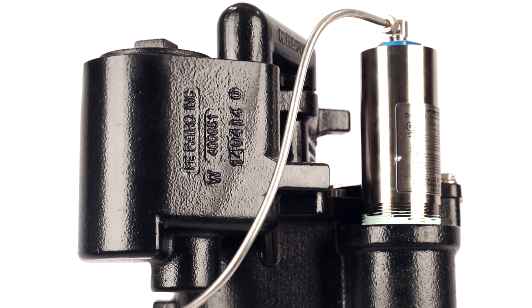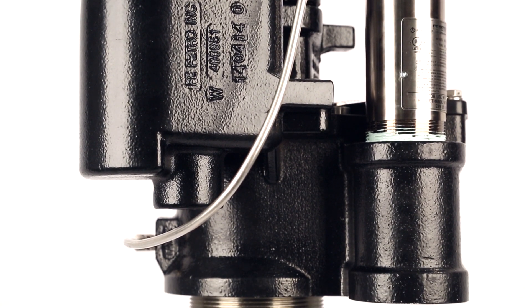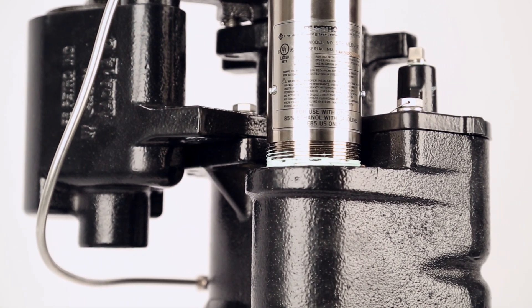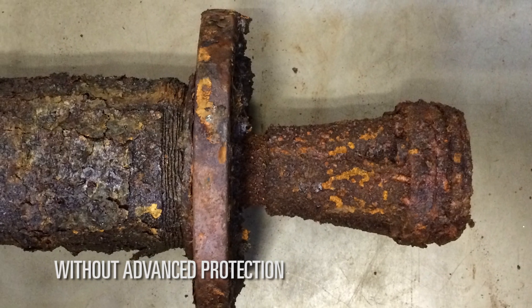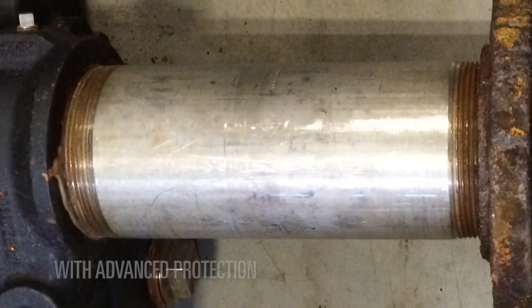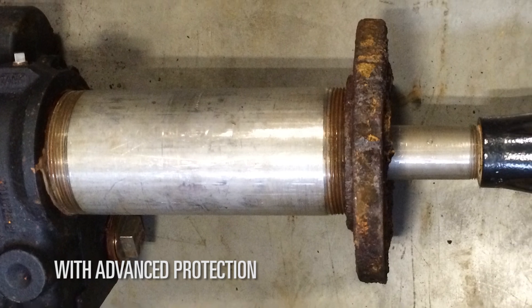Advanced protection is a new option that we brought to the four-inch submersible pump. We've brought it to the market to combat the accelerated corrosion that we've seen in tank with ultra-low sulfur diesel and in sump with higher ethanol concentrations associated with microbial activity that's creating acetic acid. This accelerated corrosion takes over very quickly — it's not like normal corrosion on metallic surfaces. When it starts, it happens very rapidly and creates a lot of debris and issues for serviceability of the equipment in the pumping system.